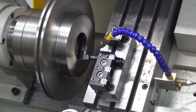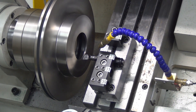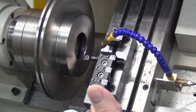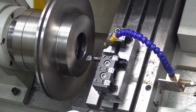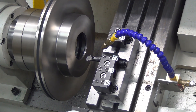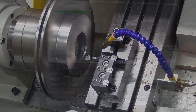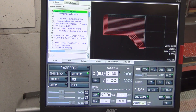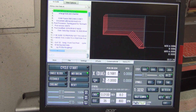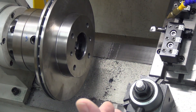It doesn't take very long, so until I see exactly how this thing's going to cut dry, I can always go back and make the cuts more aggressive and then repost the code. I've gone to minus one inch from where I was. I'll tell it to zero that — it'll ask me if I want to position that in G54 and I tell it yes.